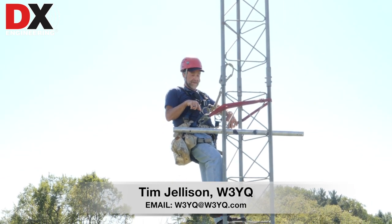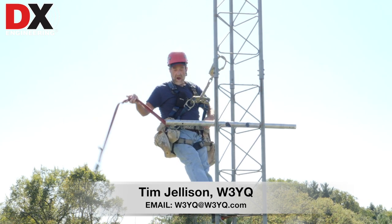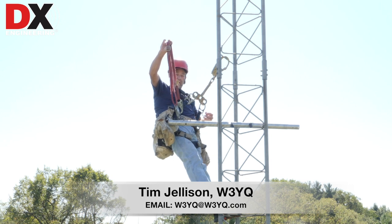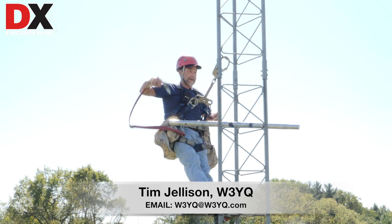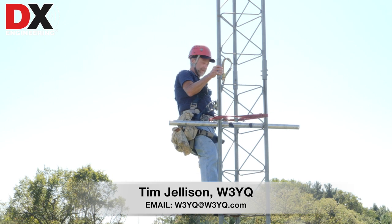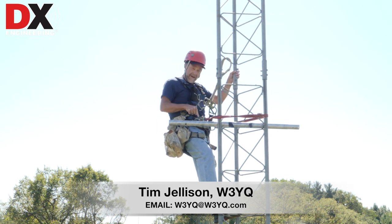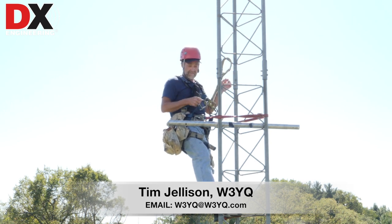The rule I've always followed with this lanyard — and I've used lanyards like this for years — is I always go in the same direction. My positioning lanyard is always attached on the D-ring on this side, and I always take the free end, go around the tower, and hook it up on my left side. Always. If I need to get around an obstruction, I never disconnect this side — even if it's more trouble, I disconnect the other side. Muscle memory. Always repetitive motions — do the same thing every time. If you start alternating, you're just subjecting yourself to more risk.